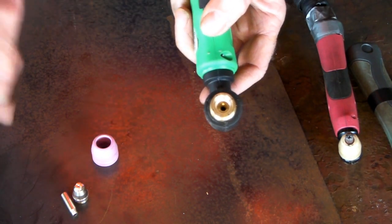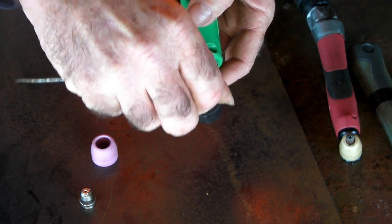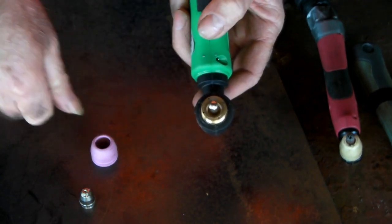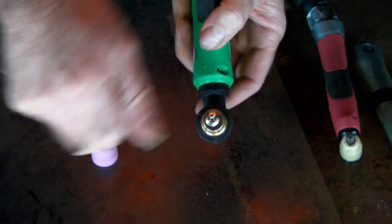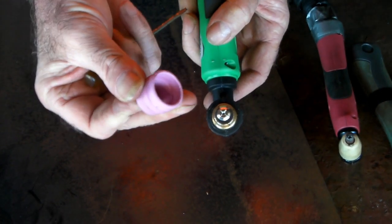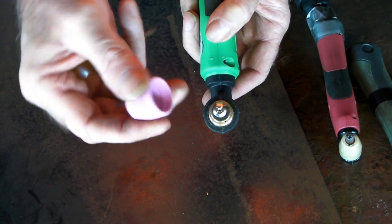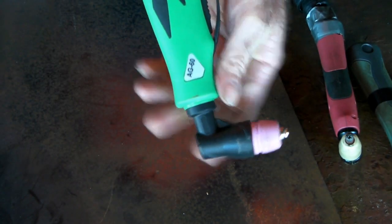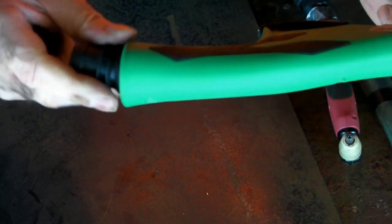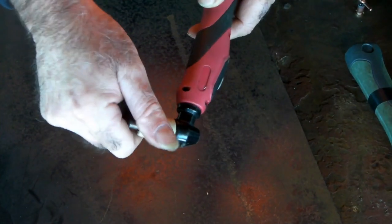Other than that, the AG60 is normally a pretty reliable torch with good consumables. They're single-use consumables - you screw in the cutting tip on top as well. Just watch for hairline cracks in the ceramics, because the arc will jump across and distort your cutting pattern. I like the AG60 - it's a reliable torch on a lot of your machines. But the one I use most is the PT31, and the PT31 has a few more issues than the AG60.